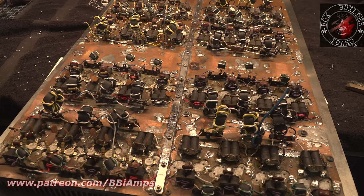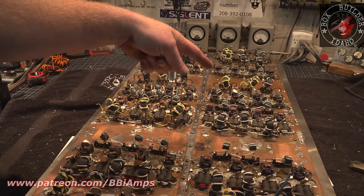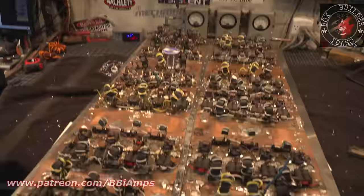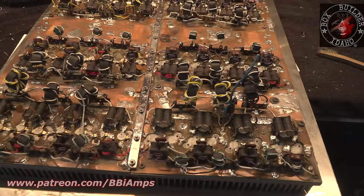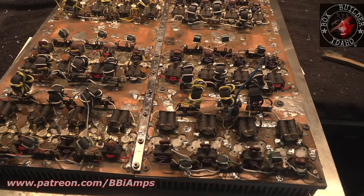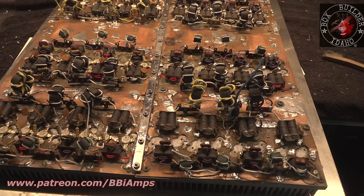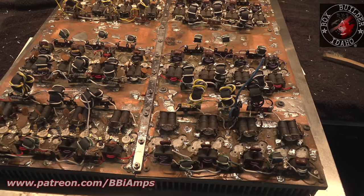Remember how I was talking a couple segments back about how when the air goes in that end of the cabinet, and by the time it gets down here, it's super heated and it can't really do any physical work, so we only got a couple different things that we can do. Split our air distribution up so we got air that goes out that way and air that goes out this way, and or more volume, right? So that's when we start talking about going to a blower.